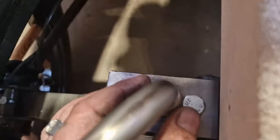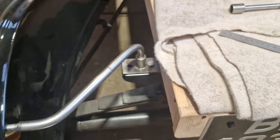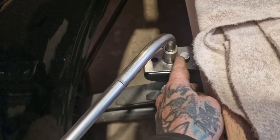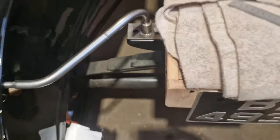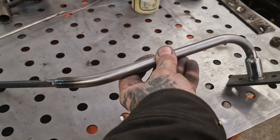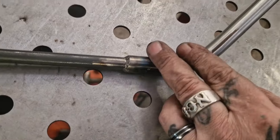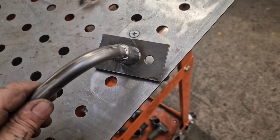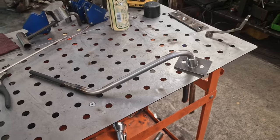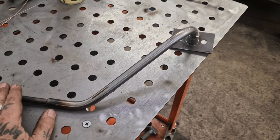I think what I need to do as well is probably tack that. I could centre-pop it, but it might not be sitting dead square - and it's sitting lovely. I might have to get the MIG in and put a couple of tacks on, then deal with that after. And there it is in all its beauty. We've done this end, extended it and welded it up. And we've welded this in place - jobs are good. What I'll do is go and bolt it back on - for me that's the easy bit. It's making the other one match, that's going to be a bit of a challenge. But we've marked it up, so we're in with a chance.